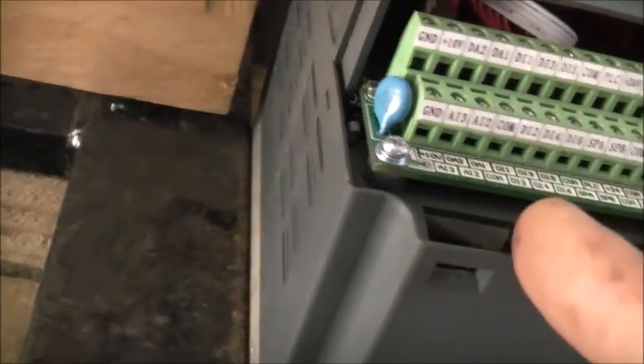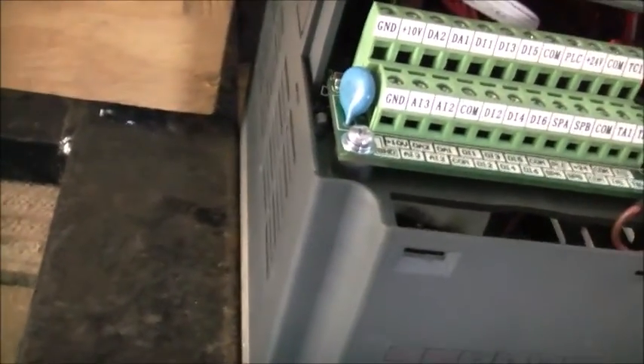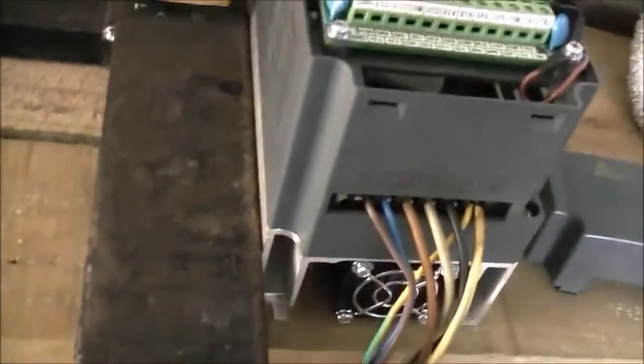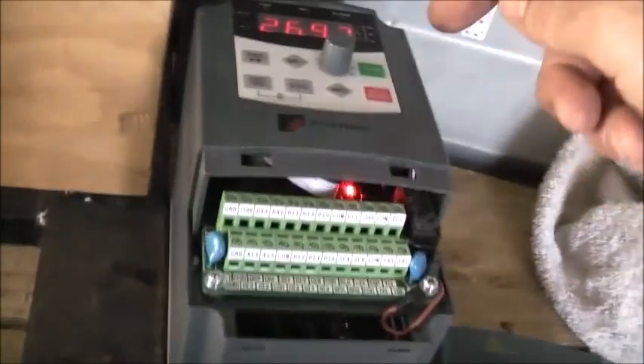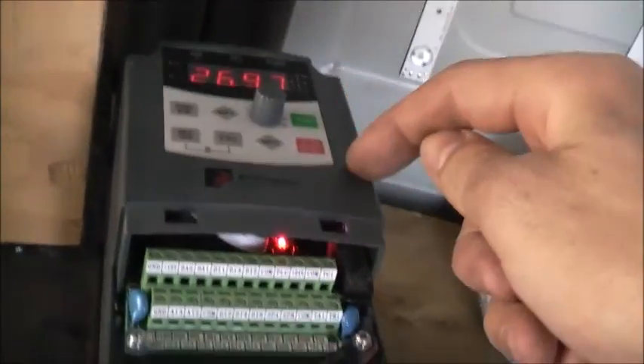And here we've got a common, ground, common, PLC. I'm just going to program some external buttons into this thing so I don't have to rely on the buttons on this control panel. I can mount this in a sealed dust-proof enclosure with some buttons on the outside — an industrial potentiometer to control the speed, and green and red on/stop buttons. I could program a reverse into this, but reverse would just make it suck air back.